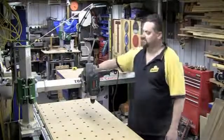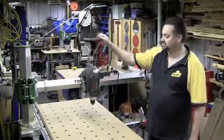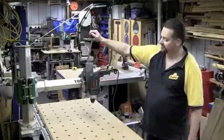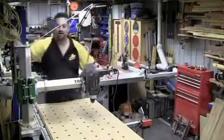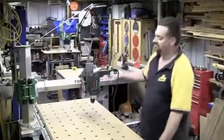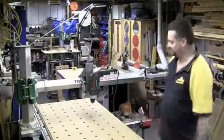The third is the Z axis — in this case, that's the vertical plunge. On this machine, we've got both the plunge itself for the tool, but I can also adjust the height. Coming around this side, I can actually wind the entire beam up and down. So that's our first three, and each one can be used either in conjunction with the others or independently.